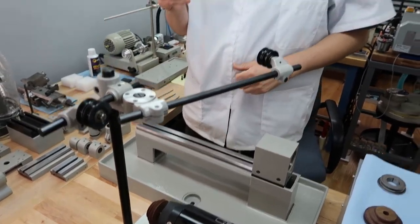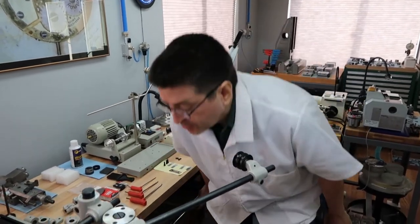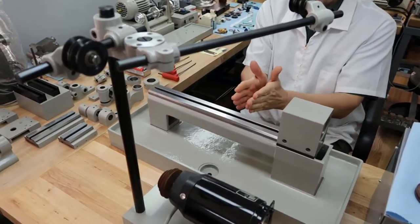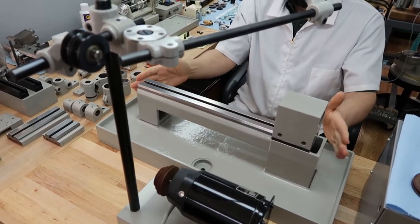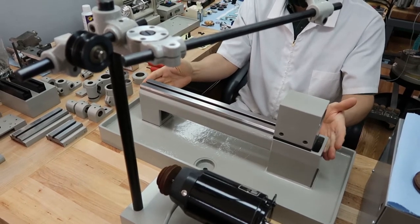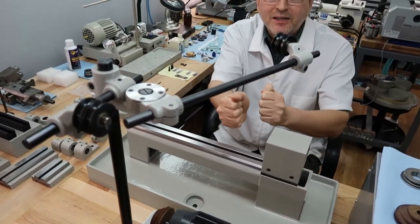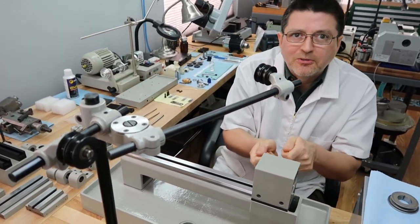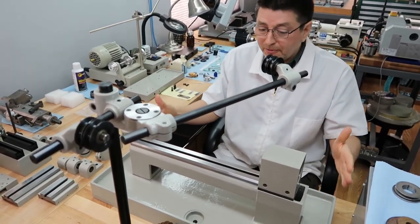Let me share a couple of things about what we're looking at and why the placement is so critical. There are three things. The first thing Lance touched on was the placement of the chip tray. When you're sitting down here, it's really important. You want the bed to be pretty much central — especially on this lathe, since we use it a lot with our turret attachment. You've got levers on each side, so you want to be comfortable and not cramped. We've got that placement pretty well perfected.